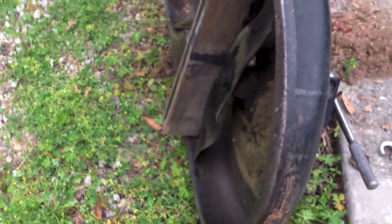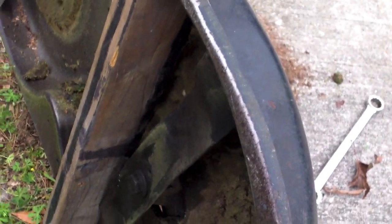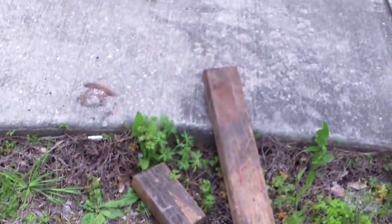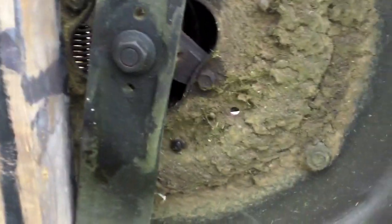I want to show you a little trick I use on these decks. Sometimes you have to take the pulley off to get the spindle off. What I have here are three pieces of scrap two-by-four treated lumber, had them probably five or six years, cut to sizes that allow me to take these pulleys off easy. I'll wedge them in here at an angle and as it rolls around it'll bind up so I can take the nut off the top of the pulley.